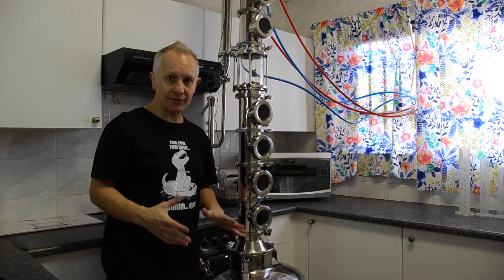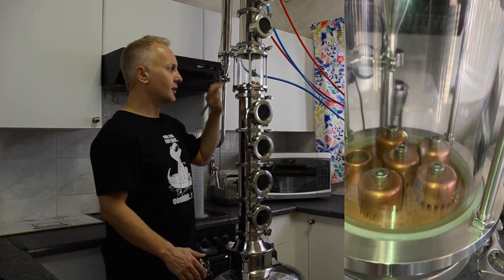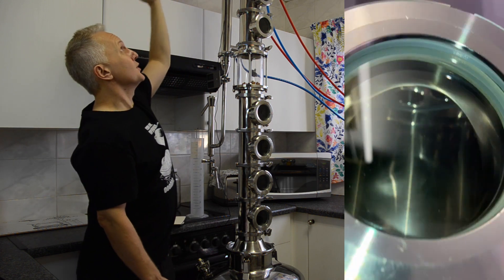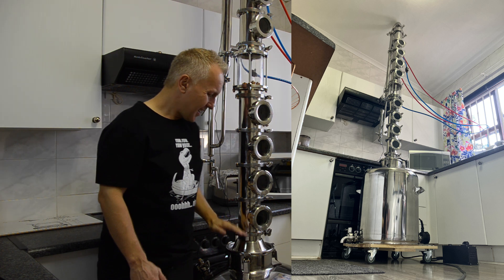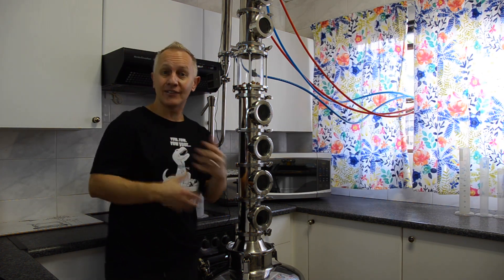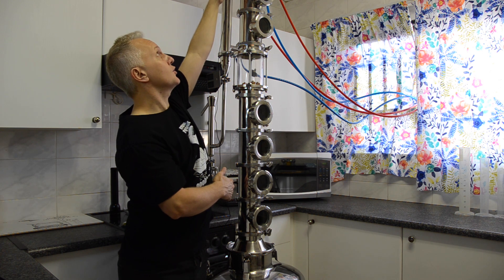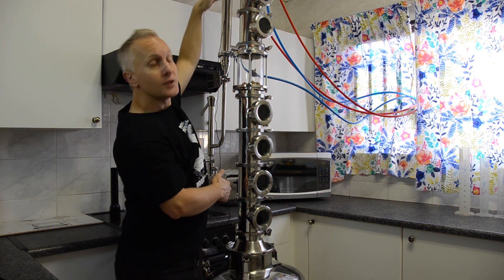The aim for the high reflux run: I've got bubble trays on every T-section, a glass chamber as well, all the way up to my reflux right on the top. You can also see I'm hitting the ceiling with my still at the moment. I've got nine trays in. Your reflux run is to try and force all your vapor up, have your reflux condenser or dephlegmator right at the top condensing whatever is getting to the top and then pushing it back down.